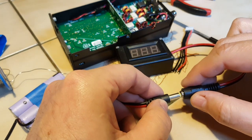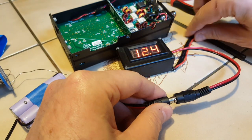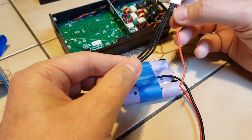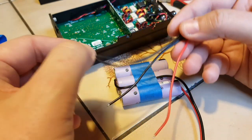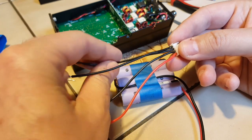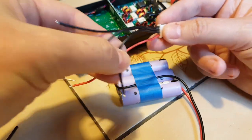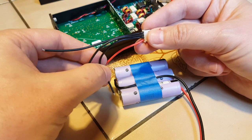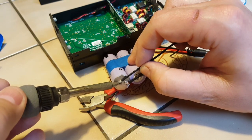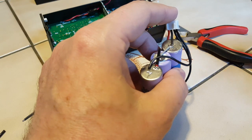Let's test it. Perfect. Now we need to attach the balance lead. So here we have the plus on this side, which will go to the same plus as the power wire. We have the minus here. The last one will go on the minus here. The next one over will go on the plus of the last battery. And this one will go right here at the minus of this one — so in between.